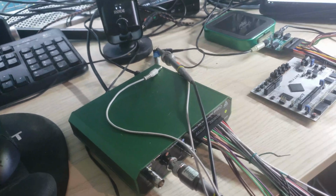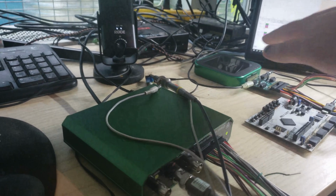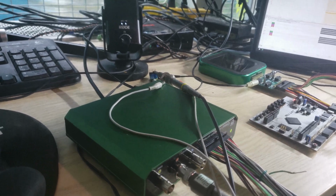It's set up just a lot better so you can make sure that there's just no gaps in your data. If you're trying to get a look at a signal that's coming in, you can picture a sine wave or something like that coming in off of a waveform generator. If you're capturing it on an AD3, that smaller buffer, if that sine wave is really fast, again, 100 megahertz or a megahertz plus, let's say, then as it comes in, it's going to get chopped up into chunks, and you're going to be missing small parts of it potentially.